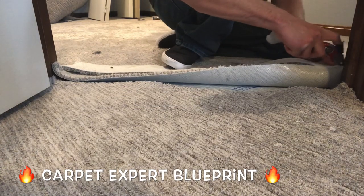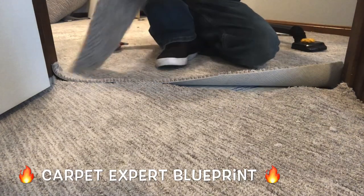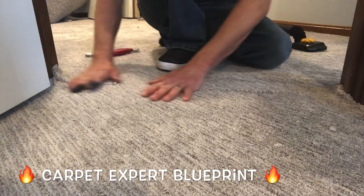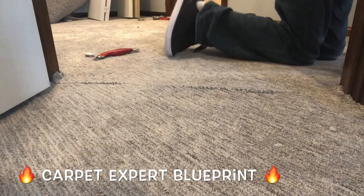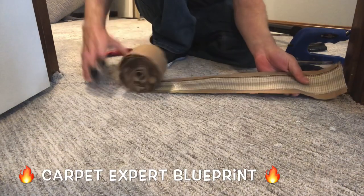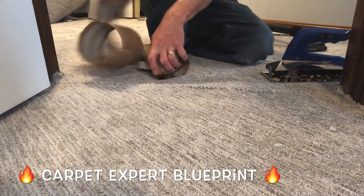Life's good in my world. Next, once we get to the other end here we're going to be ready to rock. We're going to have to get some seam tape under this seam to make sure everything is sticking together. So I'm going to holler for the magic roll of seam tape to show up once I make sure everything's lined up. Looks good so far — seam tape's ready to go. We're going to unroll it so it is the length plus about four inches of the doorway.